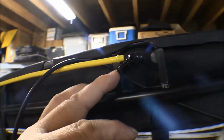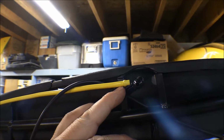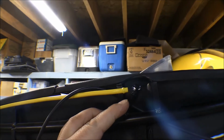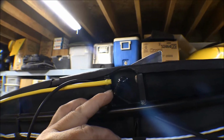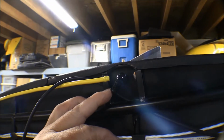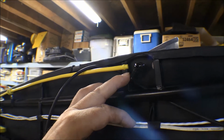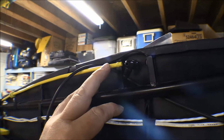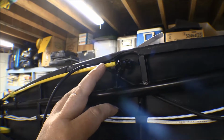We've got this T on there, and I can actually put a flare fitting on that. I had it set up to put a hose on there, and I do have a hose barb that'll fit on that T fitting that has that same AN 37-degree flare on there that is the female that'll fit over that T, but I think I'll put one of those out here on this end, and I'm just going to go ahead and put a flare fitting on that one, a nut.